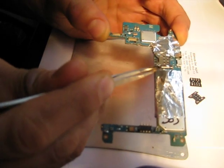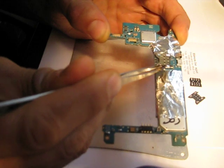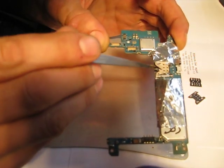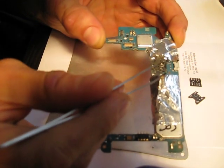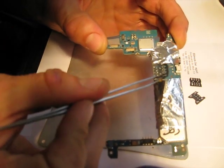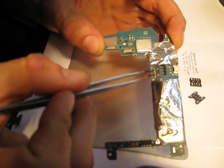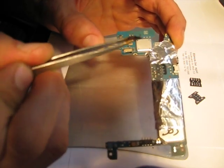The way to go is: you just cut here with a Dremel, and then try to desolder one by one — there are two points to desolder — and then the other side, and then you take this off. Probably break the plastic as much as you can here, and then heat this section, and then this will come right off.